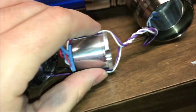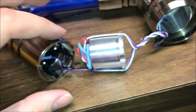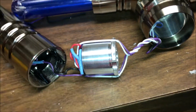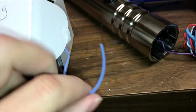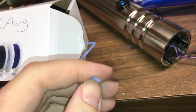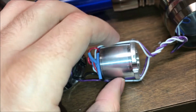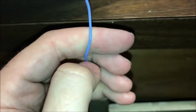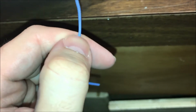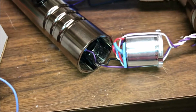And I think part of the issue, and I'm not 100% sure, mind you, but it feels like this is a plastic insulator wire instead of silicone. The silicone insulated wires are really flexible. They take a beating pretty well. These wires are more rigid, the plastic coating. I can scratch my thumb across this silicone and nothing happens. If I scratch my thumb across this plastic, it can leave marks.